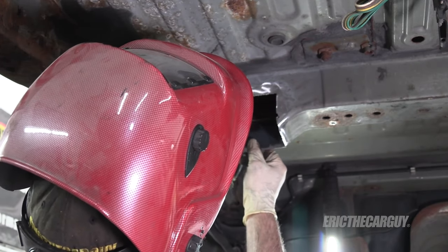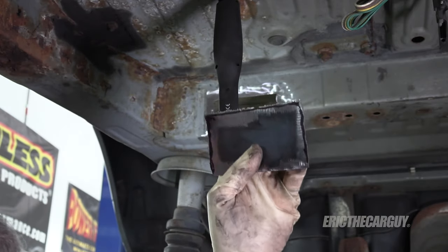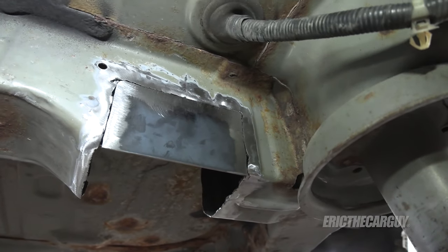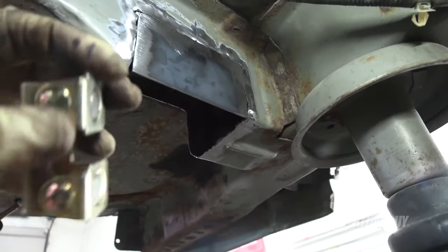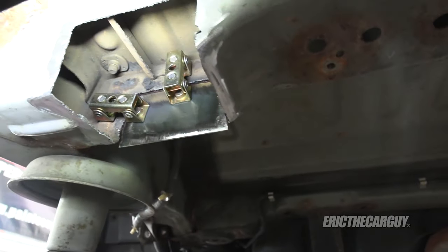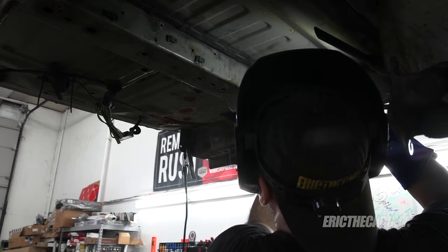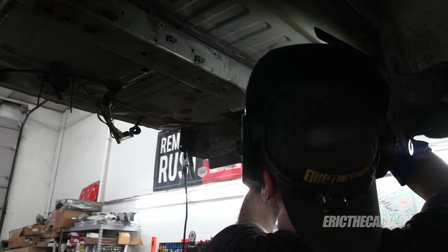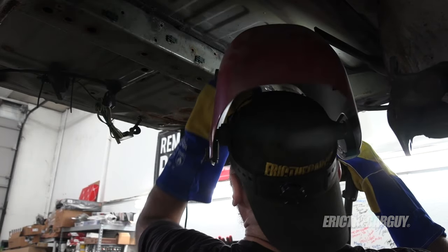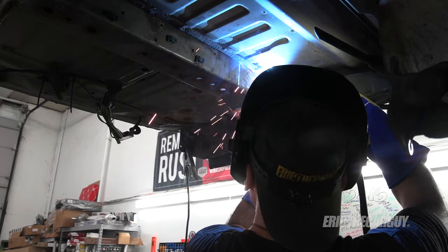Let's see if it fits. I should give myself something to trim down to — I'd rather have it too big and work my way in than the other way around. Here's my finished piece: all cleaned up, clean metal for welding, everything fits flush. I'm holding it in with magnets so they'll hold everything in place while I weld. I can bend that tab when I need to, but for now let's get this piece welded in. To avoid warping the metal I'm going to tack it in a couple of spots first before finish welding. First piece is done.